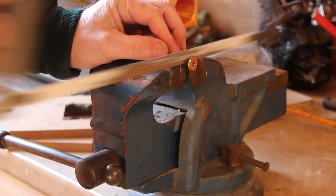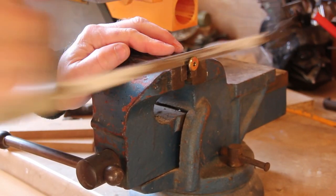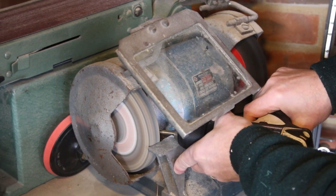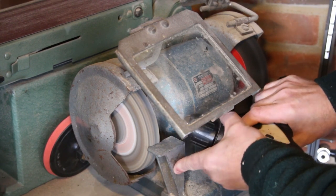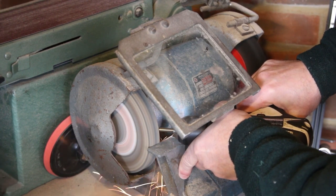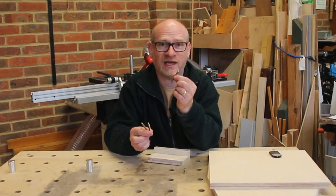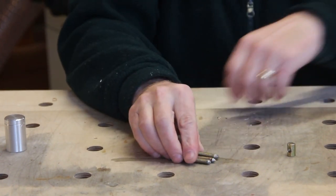I need a way to line up the holes on the parts that need joining, so I'm making some pointed six millimeter threaded pieces out of old bolts. These will engage with the barrel nuts and leave a point protruding, which I can use to mark where the other holes need to go. Here I'm using my drill with the bench grinder to ensure the point is central to the bolt. I've made three of these — they're basically just an M6 screw with a point on.